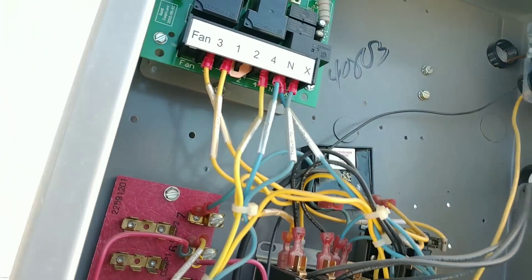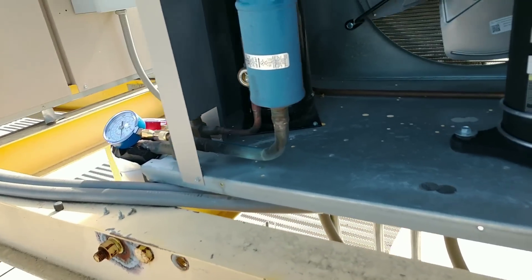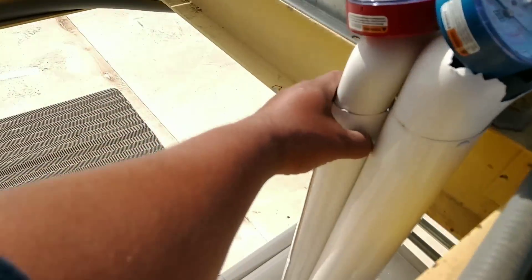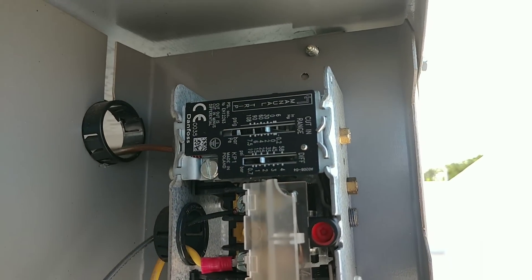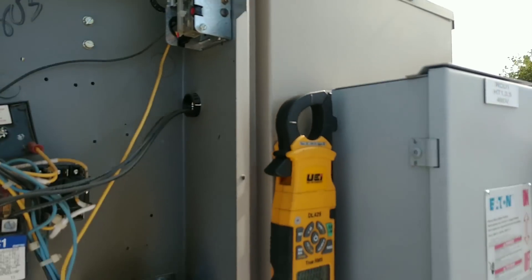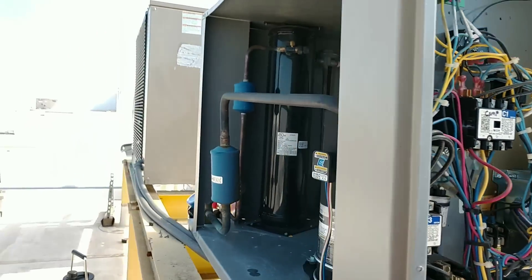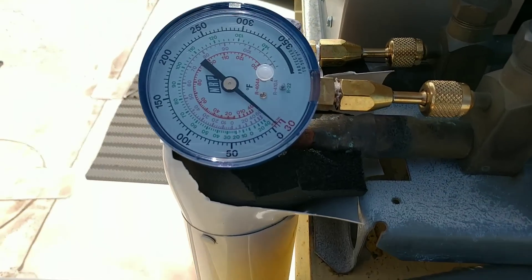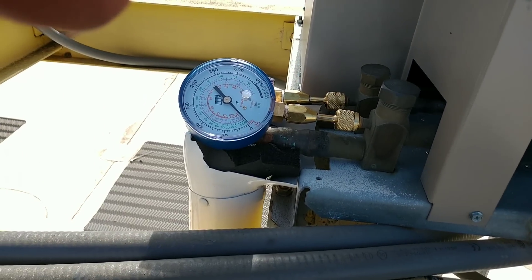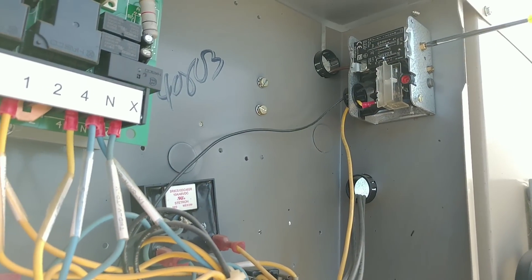We are reading 240V on it. This unit's probably pumped down. I need to go probably downstairs and check that solenoid because I don't see a solenoid out here — at least not up here. If I have 20 psi and the cut-in is about 30, let's drop it down a bit just for troubleshooting purposes. There it goes. Possibly solenoid getting stuck — let's go downstairs and check that out.